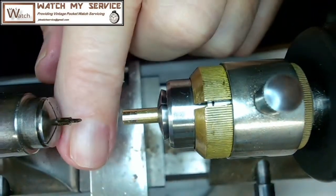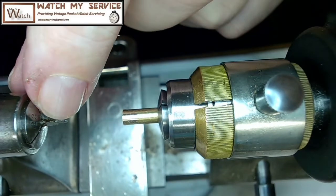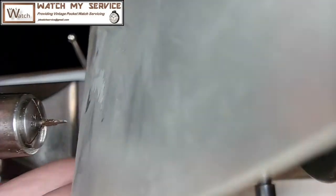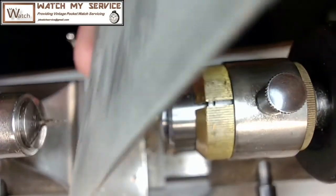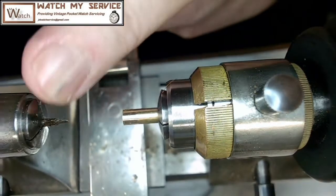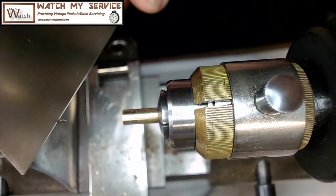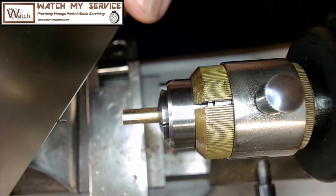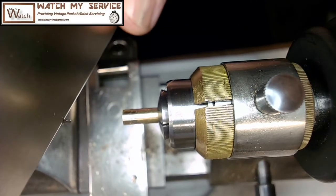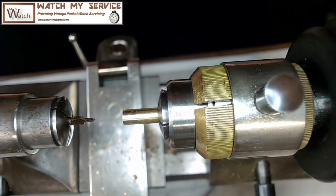I bring my diamond plate in to sharpen the secondary cutting edge — I need to angle the plate to get at this edge. I can't do it from the bottom, I have to approach from the top. I angle it and go like that — that should be enough. I add a little more oil on my finger and drop it on, then see if this cuts.